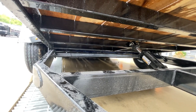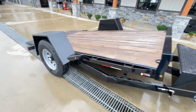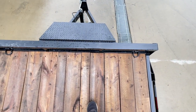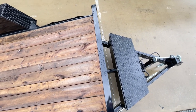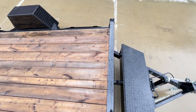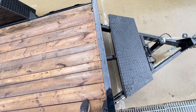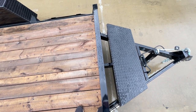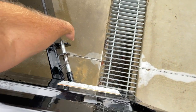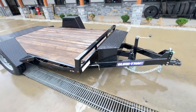Some are what we would call a slam-down tilt. This one has a gravity cylinder, which makes for a fairly smooth transition. The more weight you've got and the faster you come forward, the quicker it's going to drop. My wife comments on my weight regularly, but apparently I'm not heavy enough in this application to make the tilt trailer come down very fast. You'll see it comes down reasonably slow — put a piece of equipment on it and it'll come a little quicker. Once it comes down, just close your pin setup and it's latched out.